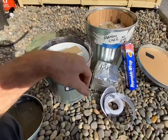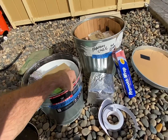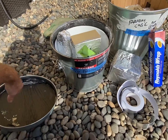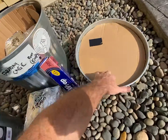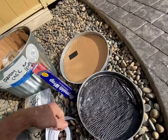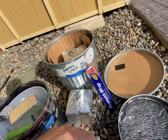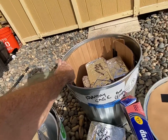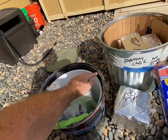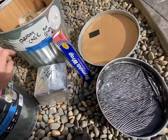The big thing to do with the Faraday cage is layering. You've got the outside can — that's the main shield. Then you've got an insulator; in this case I used cardboard, so none of the items inside get in contact with the outside shielding. Inside that you can use a cardboard layer, a plastic bucket, or foil-backed sticky insulation — that's another good option.